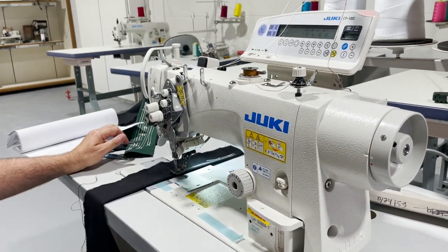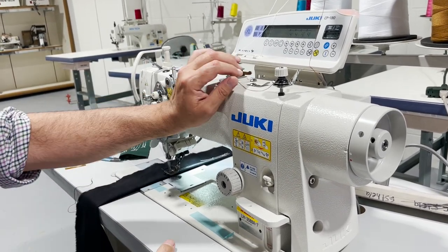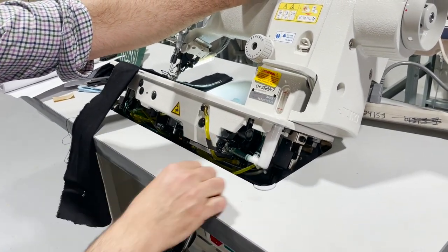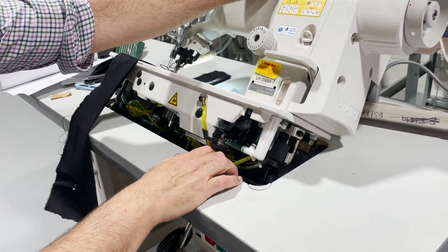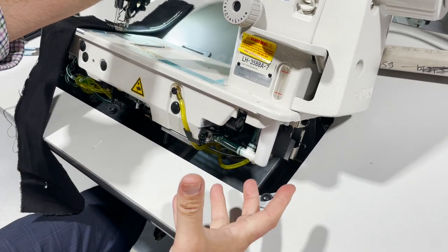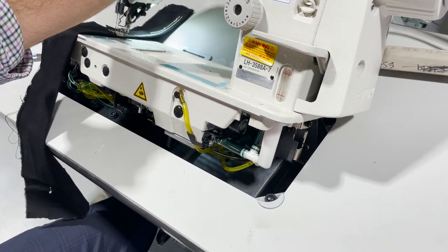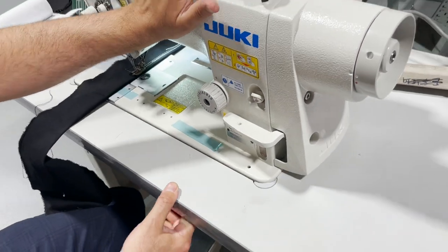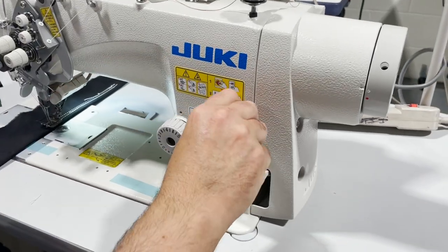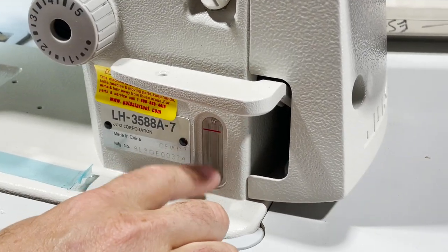The head is semi-dry, meaning that you do not put oil inside the oil pan underneath. Look. By the way, you see that noise? Whenever you open this up, it's going to make that noise. I'm going to shut it down. You don't see any oil inside. Oh, so heavy. It's the whole computer, pipes, pumps, the whole city down there. So where does the oil go? Oil goes in the head from here. When you buy the machine, open this up, drop the oil in there, close it. The oil is going to stay up here. Any place between these two red lines, you're good.